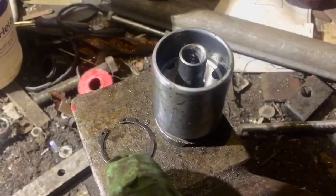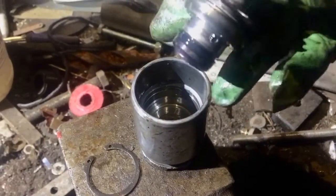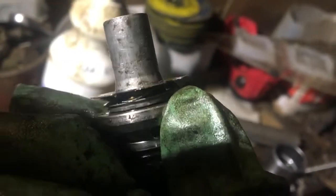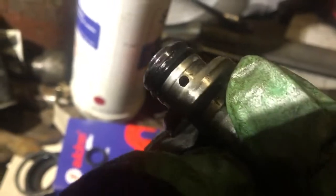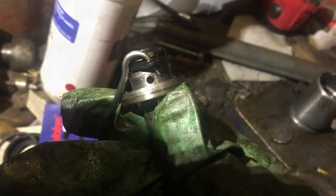Next I removed the little spring clip that sits inside. I'm going to pull all this out and probably replace the seal at the bottom — put a little bit of grease in there too and clean it all out. Next we remove the washers and the spring washers. In the kit I got the little seal, so we're going to replace this one — it's like a one-way seal that scrubs going right and pushes going left. We get our little pick just underneath it and flick it off. That's the old seal removed and the new seal reinstalled.